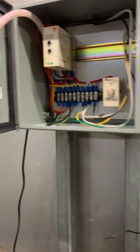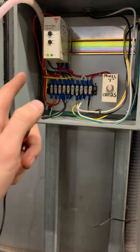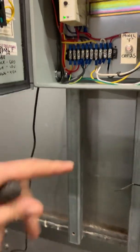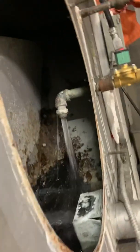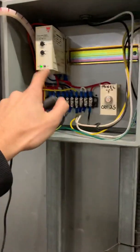Then I tested my system. I couldn't drain it the normal way, but I manually drained it with a bucket until it needed to fill. I verified that the controller would fill when required and turn off when it hit the max sensor, which it does. It's in auto so it's not running right now because it's full. If I turn it to hand, you can see it's filling. I'll turn it back to auto. When you see it energized, that's when it should fill. So I fixed that problem.